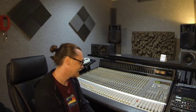Some of these rack units are in a metal chassis. It will be grounded to the chassis, and if it's not screwed into your rack properly, you could also be introducing some kind of problematic grounding effect that way, and that could be introducing your buzzing. It could be something within your console. You could have a capacitor that's going bad. Fingers crossed it's not that.